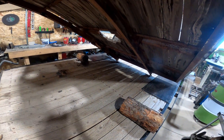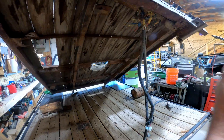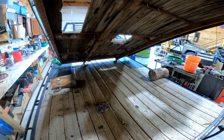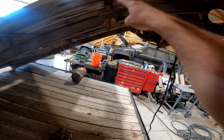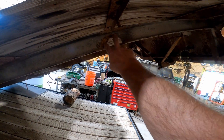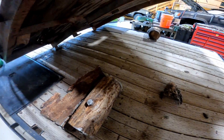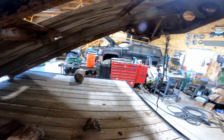This was on a Ford pickup and it's going on a Chevy now. They have these brackets that I'm pretty sure are in the wrong spot — they're like half-inch or three-eighths angle, four by four or four by three. Those are probably gonna have to come off. This truck must have originally had two filler necks — they notched this main piece here and chopped this right here for the other filler neck. I'm gonna have to fill that and reconnect this.